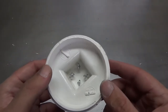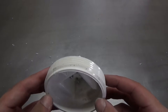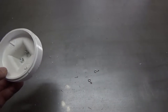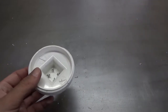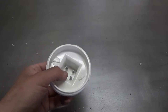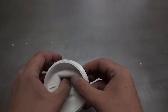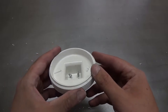I got my four eyelets in there. I've broken steel bolts in aluminum housings before, but I've never broken steel eyelets in a plastic part before — let alone two of them. Anyway, I'm going to mix up some five-minute epoxy and let that sit in there, not only to seal up the little boo-boos from having to re-drill, but also because there's not a whole lot of thread biting in there, so the epoxy will help hold those in.